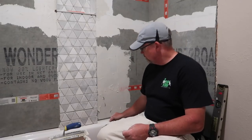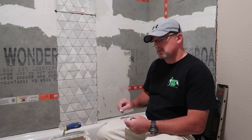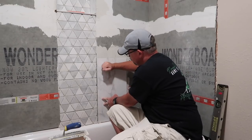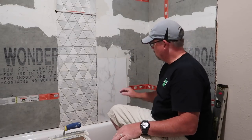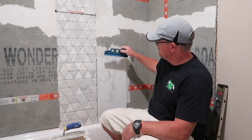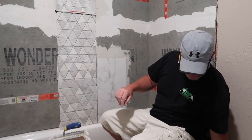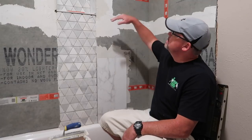I'm going to directly set the tile right on top of the tub. I'm going to use these spacers right here and set the tile right on top of those spacers. That way it keeps the tile off the tub just a little bit and gives a little room for grout underneath. I'm going to pound that tile on there hard. You always want to start out level — all your tile always has to be level. I'm going to check for that to be level. That's good. Now I'm just going to continue up the wall, checking level, making sure everything's perfect as far as square and level and all my grout joints are the same.